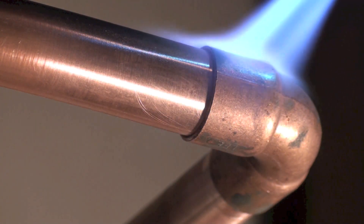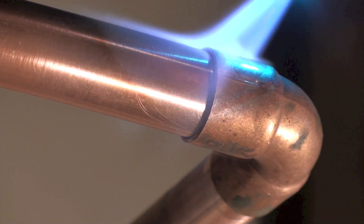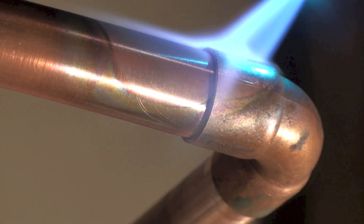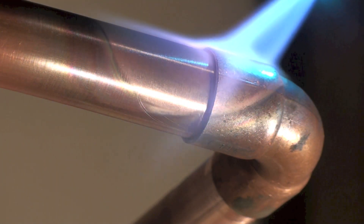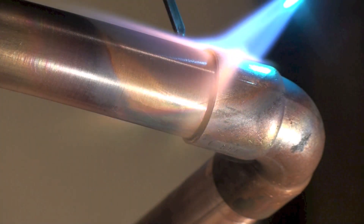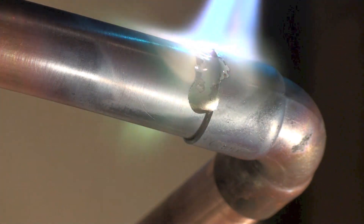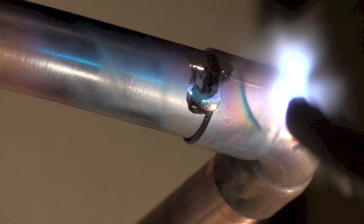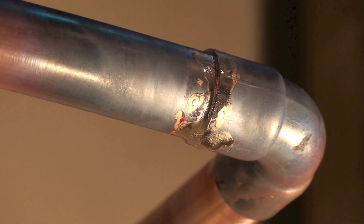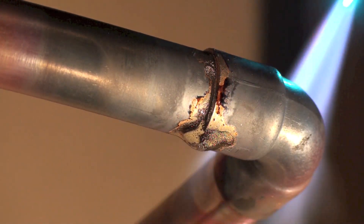Okay, here's another fitting a little closer up. Try not to let the flame melt the brazing material — let it melt because the metal is hot. By the way, this is only good on copper; real hard to make it work on anything else, though you can if you're really good at it. You can see there the following of — you actually kind of push this stuff around with the brazing rod itself — and on the bottom you want to make sure when you're done you get a little extra on the bottom and you should have a little drip like that.